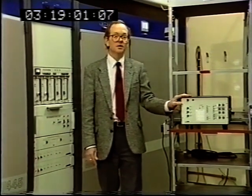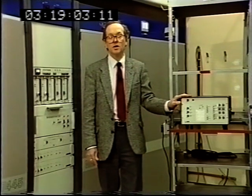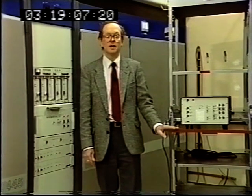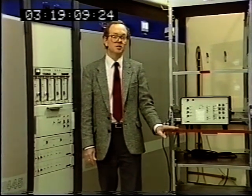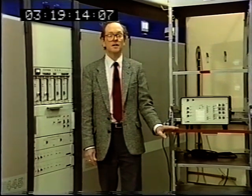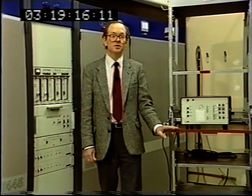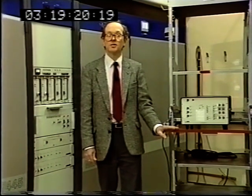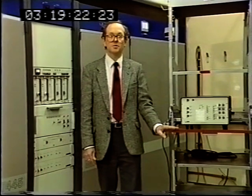As you might already know, the Black Mountain team's development work resulted in a modification that's been fitted to these generators. This expands its capabilities to provide a range of distorted ITS waveforms, again digitally generated and therefore stable. These can be used not only for checking the calibration of AMEs, but also for checking the operation of other equipment, waveform correctors, for example.